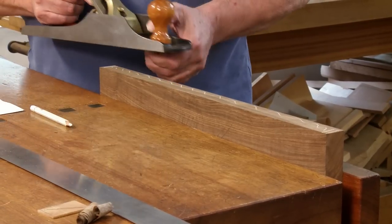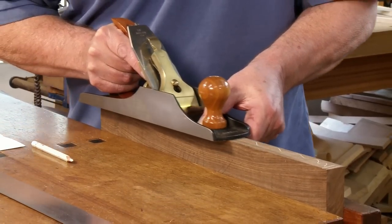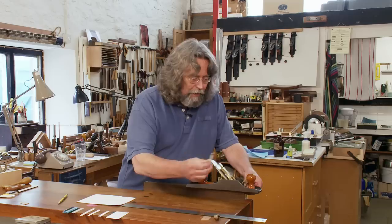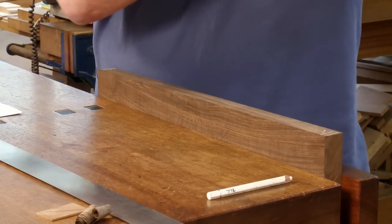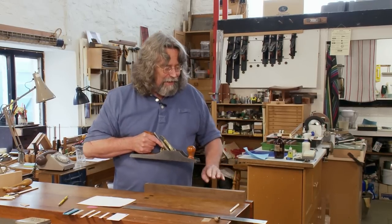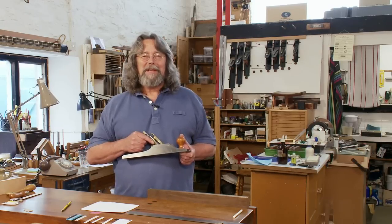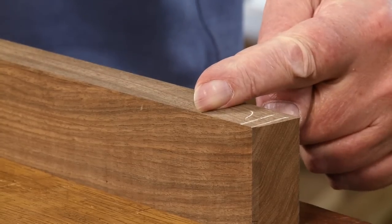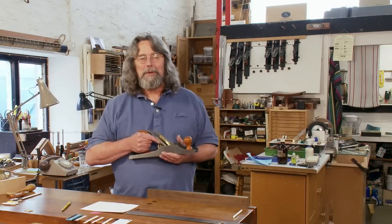Starting in the right place is not too difficult. The difficulty comes in trying to stop in the right place because I can't see the timber. It may help to have a little telltale on the bench which indicates when you should lift the plane. It's important that the plane is moving when you lift it — if you stop and lift, the shaving remains attached to the wood, pulls back through the mouth of the plane, and it can often take a minute or two to clear it.